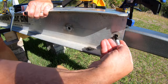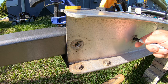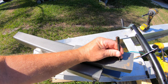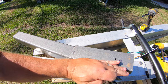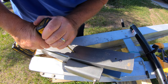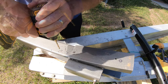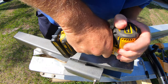The new hole locations are marked and verified one last time. Then I used a center punch to mark them and a series of successively larger drill bits to drill the holes. I finally threw out all the drills I had and bought new ones. A tip I found was when drilling metal it's easier to use a small diameter drill to make that hole and then go up to successively larger bits until you get the diameter you want.